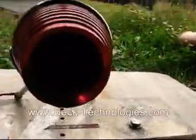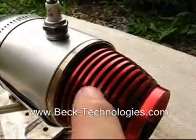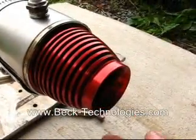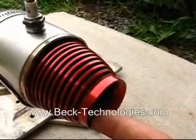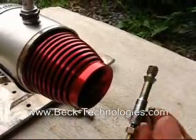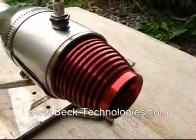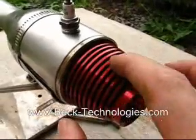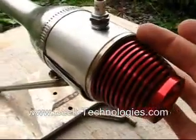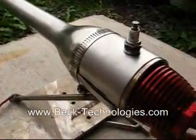The valve head has a tapered intake that leads into 10 openings for the valves, and each opening is covered by a valve petal. When air flows into the intake it acts as a venturi and pulls the fuel up from the fuel tank through the fuel venturi itself — they usually call this a flowjector. The fuel bursts into a fine spray around the middle of the intake, then travels through the 10 holes past the valves and into the combustion chamber where it burns.